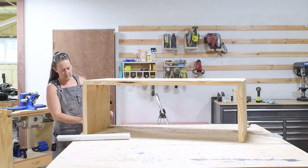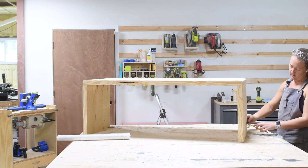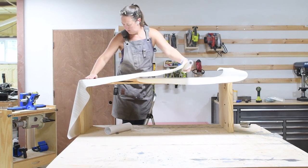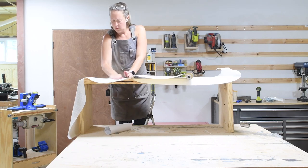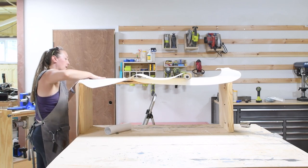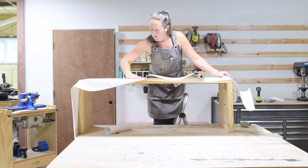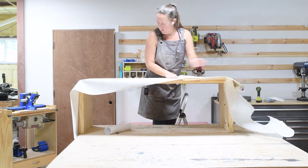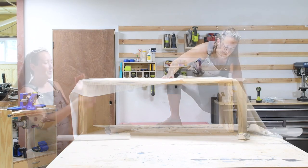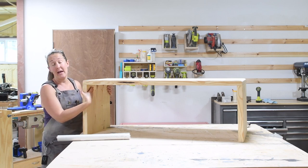Next I'm applying the wallpaper, which will require a seam on the top because my wallpaper is 20 and a half inches wide while the coffee table is 18 inches wide plus a one-and-a-half-inch thickness on each side. I'm going to offset my seam and try to line up as best I can. This is a peel-and-stick self-adhesive wallpaper, so I'll just apply it and see what happens. If it starts to peel up later I'll go back and add wallpaper adhesive. Around the edges I'm treating it just like wrapping a present — folding over and cutting around all the edges.